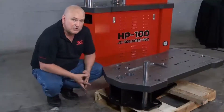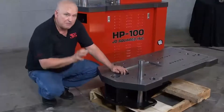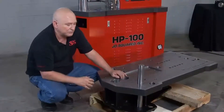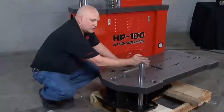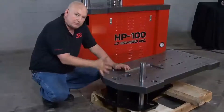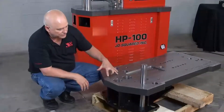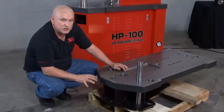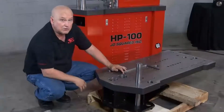Another key feature is that this is machined in a Haas VF9 in one single operation. It took us a while to design something that met all rigidity requirements and could be done without multiple setups — the first frame had five or six setups. We bought the expensive tooling to do it in one operation because we need 90 degrees from one surface to the other, and we cannot risk removing the frame, flipping it, or repositioning it. These four holes up here are for bolt-on tooling and other tooling we'll be bringing out. Our plan is to have the best-tooled machine in the world within the next year, with more tooling available at much less price than anybody in the world. That's my personal guarantee.